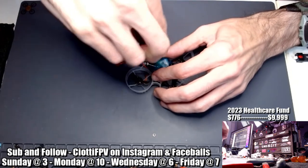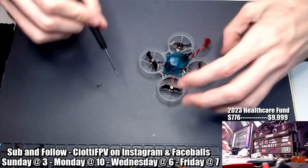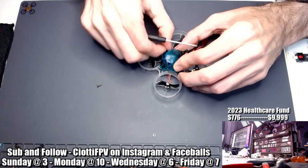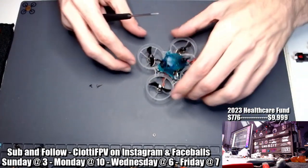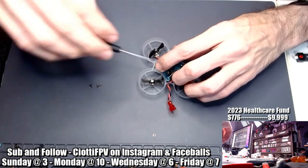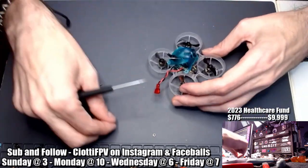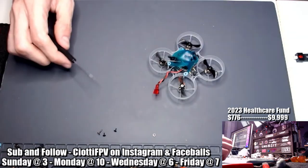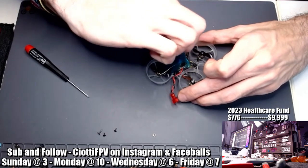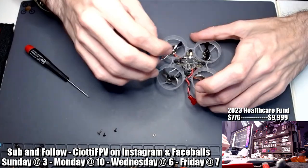All right. Let's pop this thing apart real quick and get BT 2.0 installed so that I can run my normal batteries, which is going to give us more runtime and more power, which is like the greatest thing on earth. It's my favorite thing about BT 2.0 that you get both. Usually you can either get more power or more runtime, but you can almost never get both. But with battery connectors that have less resistance, in situations where the connector on the quad has too much resistance, you can actually get both things, which is just awesome.